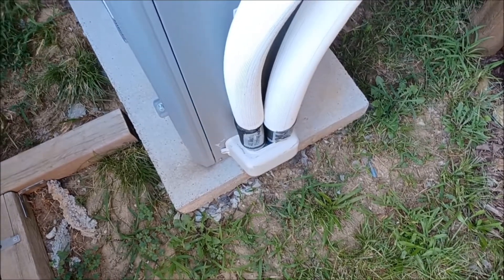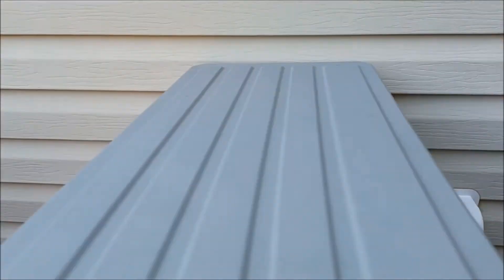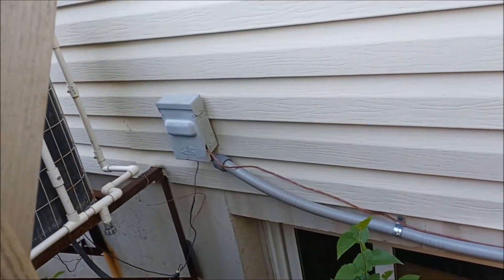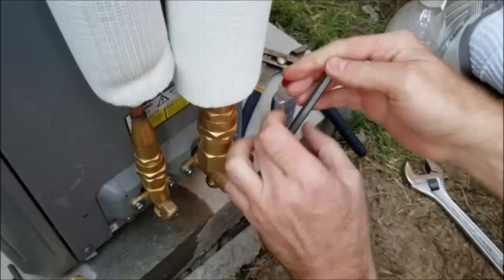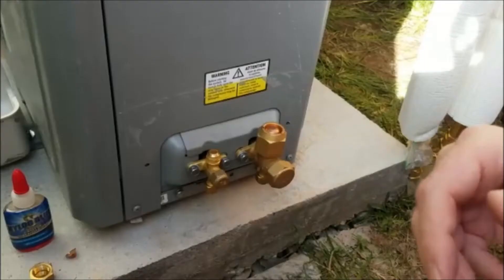This is the final walk-around. I've got a couple of things I still need to tidy up, but it's 95% done. Here's my little rain shield, and I need to wrap the insulation where I bent the pipe. Like I said, it's been running for a year now and it's been really great. I only had a couple of gripes about the system. One thing I didn't like is that it didn't provide enough insulation on the line set — it came up short, leaving about four to six inches of missing insulation, which does affect efficiency. I jury-rigged additional insulation to cover those line sets to the valve. The other thing I didn't like is I had to put a plastic bag on because one of the end caps was missing on the line set. Other than that, I thought it was a good system.